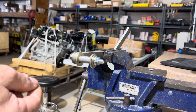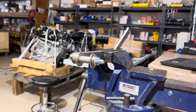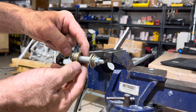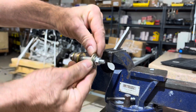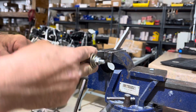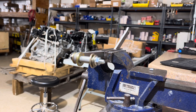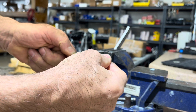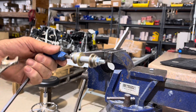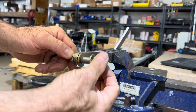Once we put paint on our pivot point — meaning the arm coming down from the wing — it makes this fatter. Now this is kind of a bearing surface because it can slide against that. It can also slide against the pivot. This can slide against the pivot arm from the wing. So we have lots of sideways bearing for side thrust, but there is no side thrust. We're still going to focus just on the fact that this has to be rigid this way. This video can stay up forever and hopefully it'll help somebody.